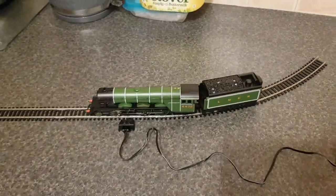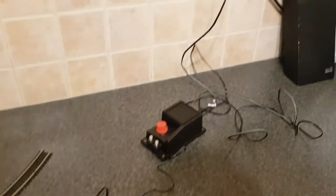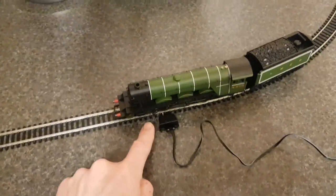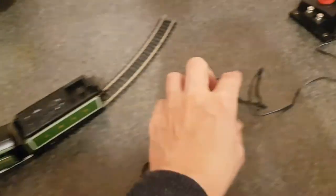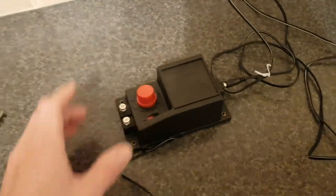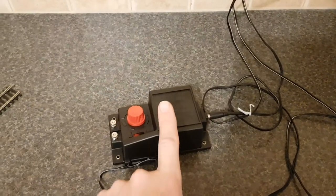So that's all there is to wiring a model railway controller and getting your layout up and running. Any problems usually result in a loose connection here or here, maybe damage to the wire or a faulty power pack. So if you have problems, first identify whether this is providing power to your controller and this is providing power to your clip.